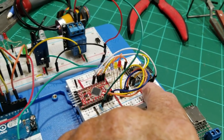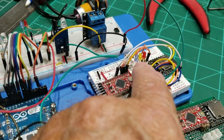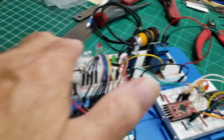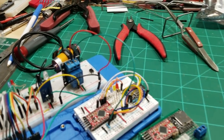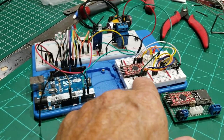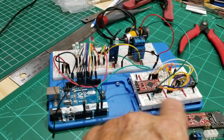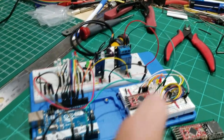As the welder sound goes, so do the LEDs for the welder. Once that's finished, it transfers back and eventually shuts everything else off. The problem I was having was when I connected this one directly to trigger the other one, it wouldn't stop. Something about the two of them being hooked together messes up the sketch — when I was looking for a signal to be low it was still high. I had to put a relay in there, and the relay resolved the problem.